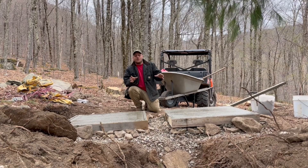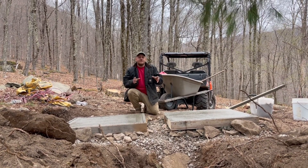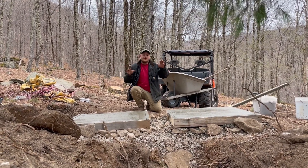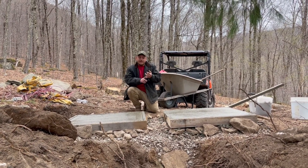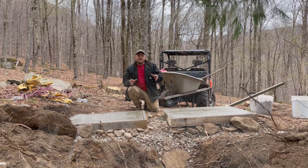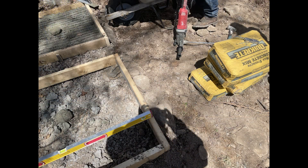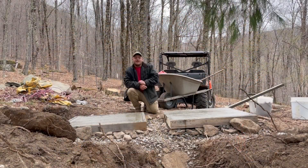As part of this project, we're also looking to install some energy-saving measures. I'm out here back behind the monastery and we're going to be installing some very large heat pumps. The heat pumps will heat the place, cool the place, and even work as a dehumidifier. I had to get back here and pour some slabs. We poured three slabs today with about thirty 80-pound bags of cement, and that's where the power station comes in handy.